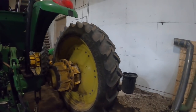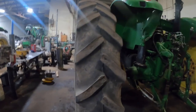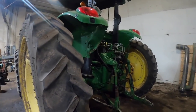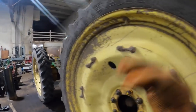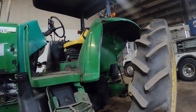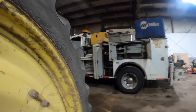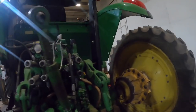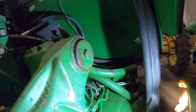The mechanic, Moss, noticed the tires were scuffing and thought, why is it doing that on new tires? He got up there and his first thought was maybe the operator was driving around with the diff lock on. But the operator was not — the diff lock is stuck on, it won't come off. I think it's hydraulically applied. I remember checking it all out and I'm going to check it again.